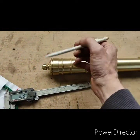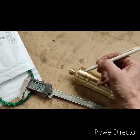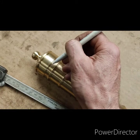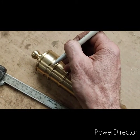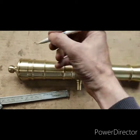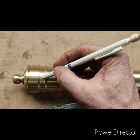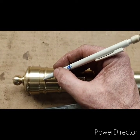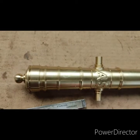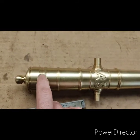Next stage — drilling the vent field. If you recollect, I drilled 10mm in, and the 10mm mark comes to about there, that's another 10mm and another 8mm, so we've got 18mm in. What I did when I took the drill in with the lathe was drill just short of the vent field, because I want to drill this vent field without the fear of snapping a drill bit. If I snap a drill bit in there it's curtains — there's no way of getting it out without making a mess.